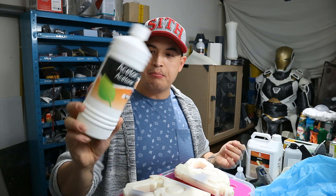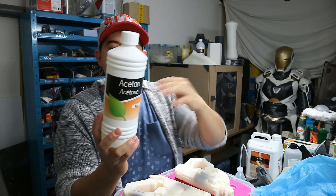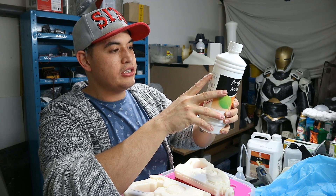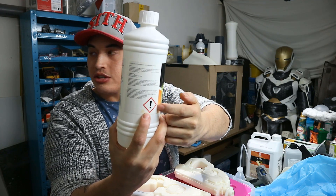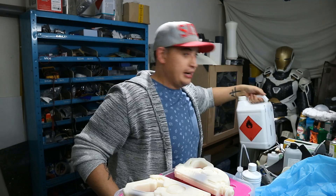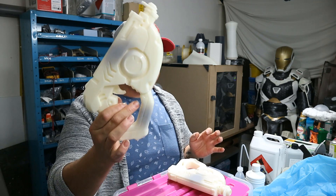There is one thing I'd like to bring to your attention. I bought this by accident — it's acetone and it says 'eco' on it. This stuff does not work for vapor smoothing. You can recognize it by the ingredients: it's a mixture of things, it's only irritating to the skin, and it's not flammable. You need the pure acetone that IS flammable. Otherwise this won't work — stay away from the eco stuff. The method is pretty safe to do because you don't heat up the acetone; you just enclose the vapor coming off it in a small closed case, and it gets amazing results.